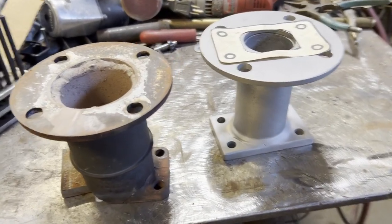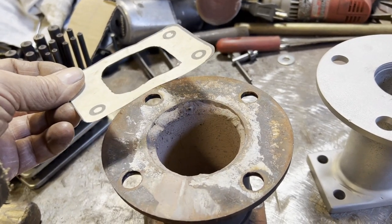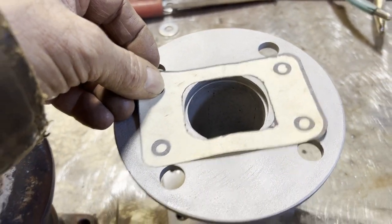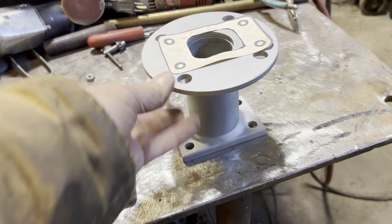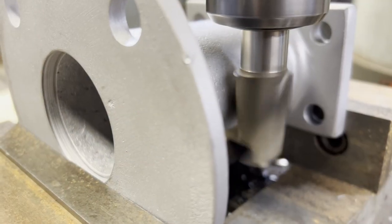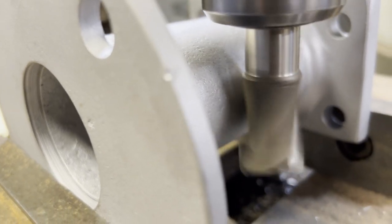You can see the original one opens up much larger than the piping, but it narrows down coming out of the manifold, and we've never had a problem. As long as we're sizing it to the port coming out of the manifold, we haven't had an issue. And remember, these are natural gas engines, so 1800 RPM would be cranked up pretty good for them.